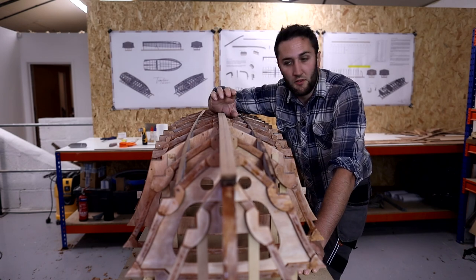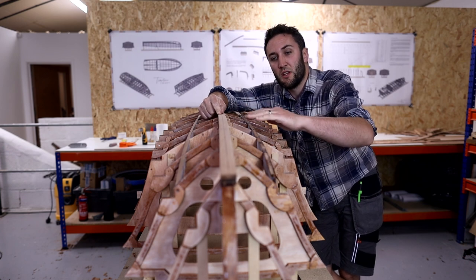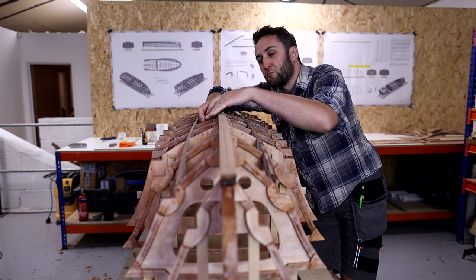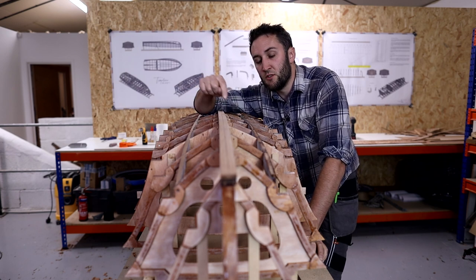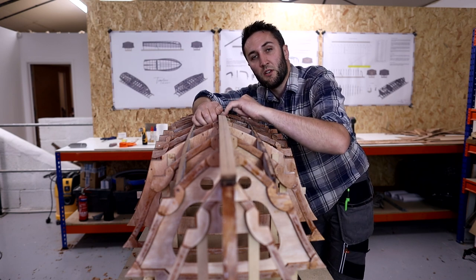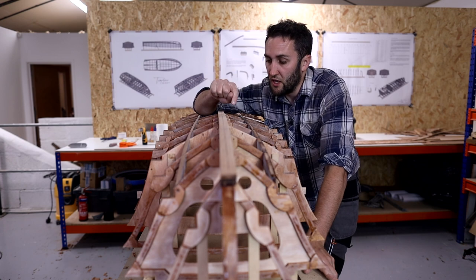We need markers on each of these frame stations to give us the shape that the keel needs to follow. I'm probably going to use a combination of both methods - I can draw a line along the edge of the keel in the same way that we did with the stringer by running a batten along it, but we can also cut notches into this keel and effectively project the line of the frame up and through the keel on both sides. That's going to give us our shape so that when we're actually planing down, we've got a little guide in each station - a sort of early warning stopping mark. We'll keep the line on the side of the keel in sight the same way that we did on the stringer, and we'll keep the center line here as well.